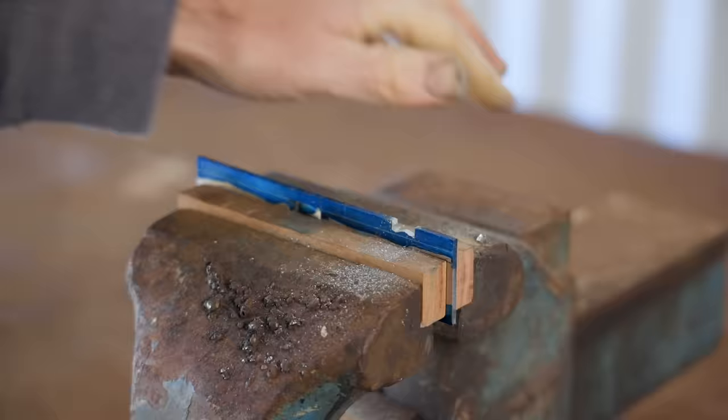I did a test and after 4 hours I couldn't get the pieces apart, and it's not at full strength until 24 hours. I could have used 5 minute epoxy even though it's very weak. I could have put pins through the pieces and into the sole, but I reckon this product looks very promising, and I could always put pins in afterwards if I feel like it needs it. I used an old screw with wax on it to protect the threads from any stray glue.